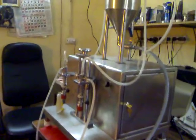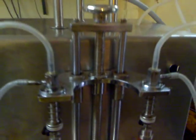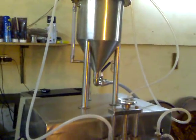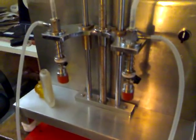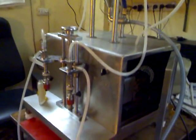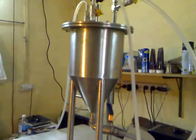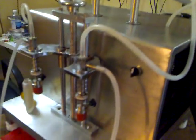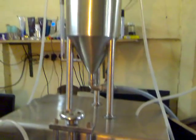This is a vacumetric perfume filling machine manufactured to fill two perfume bottles at a time. This machine works on the principle of vacuum suction. The machine consists of a main structure, a belt-driven vacuum pump, a trap vessel to collect the overflown liquid from the nozzles, two filling nozzles, and filling lines.